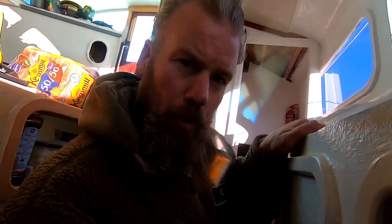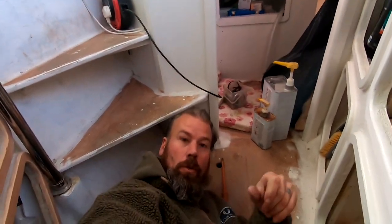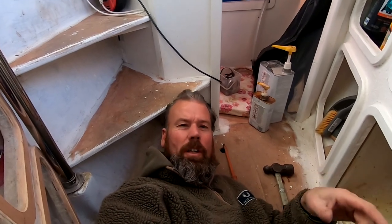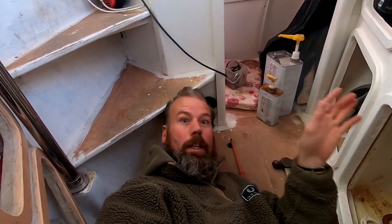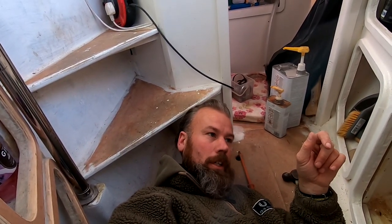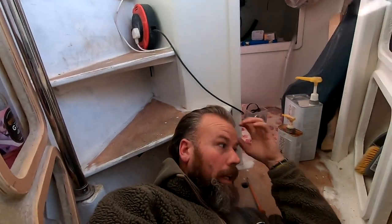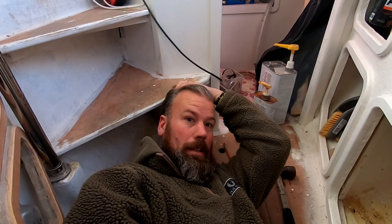Usual crazy mini jobs - I've got a quick hour in between finishing work and speaking to a potential new employer. I thought I'd use that time wisely. You've seen me do fiberglass, but underneath the underside of the through hull repair there's a little bit of delamination - picked up on the survey, ground out, glassed up. The anode - the big anode I put on last year - the surveyor said I didn't need it, so I've removed it, glassed the holes up. On the outside done, on the inside still needs doing - that's just taped up for now and I'll do that before crane-in. Another thing picked up: obviously all my through holes are Trudesign, minus the galley outlet.